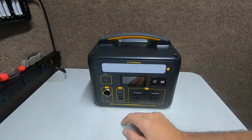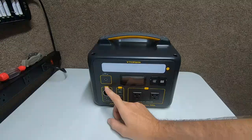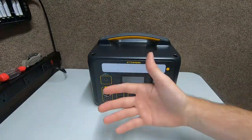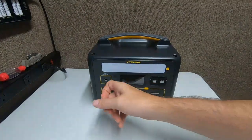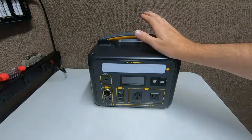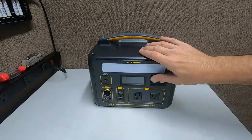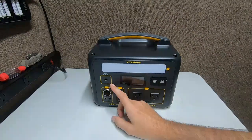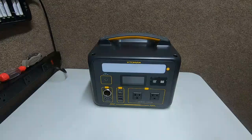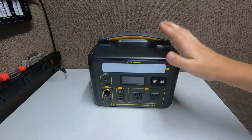What I would do is put a 200 watt panel into this. Now a lot of people would say put 100, but I like to over panel, guys, and that way you always get that full 65 watts, even on a really cloudy or crummy day. So I always over panel. I'm a big fan of that. As long as you don't go over the voltage, I like over paneling as far as the amps, because you're definitely going to get a lot more on those bad days.